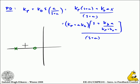Now, the other way to do it is you say, okay, I'm going to use a microcontroller. So I'm going to take my sensor and put it probably through an analog low-pass filter, roll it off, and then shove it into my A to D. And then I'm going to sample it at a fixed uniform sampling rate. And this is actually very important: if you have jitter in your sample rate, your control goes all out of whack. But then, by simple multiplications and additions, I can implement any compensator I want.